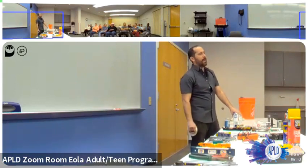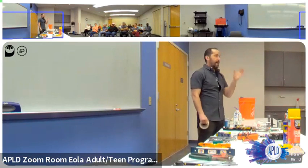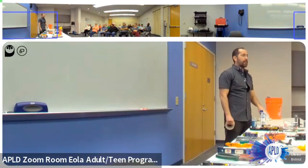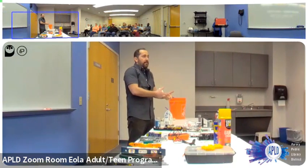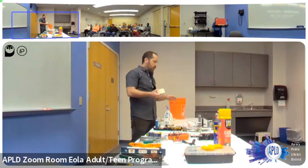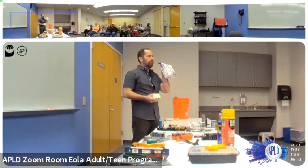Plaster. Why is somebody always going to hang on plaster? Listen. That's what my house is. If what you're doing in plaster is simply making a repair, okay, you can absolutely use modern gypsum products to fill holes, repair cracks. Usually the plaster will be harder, so over time, that crack, that damage will reappear. Depends what caused it in the first place. Okay. Plastering. I mean, you can buy this stuff yourself. It's all plaster in. It's just harder, really, right? Like it's just a stronger product at the end.